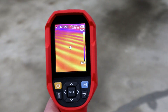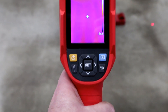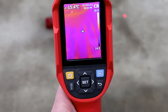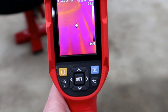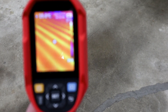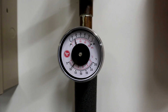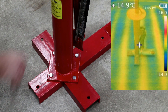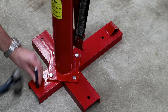If you don't have a hydronic floor, you can skip ahead to the next chapter. But if you do have a hydronic floor and need to drill into it, what I'm using here to find the lines is one of these thermal imaging cameras, so I can see exactly where the lines are. I'm going to position the tire machine so the mounting holes are hopefully lining up between the hydronic pipes. I also thought I'd better check the pressure of the hydronic system on the off chance it drops substantially after I drill the holes. Now that I've got it positioned, I'm just going to mark each hole location with a punch.